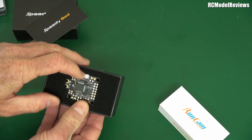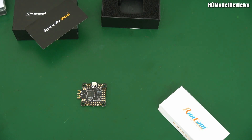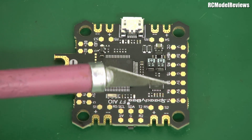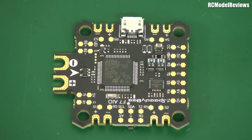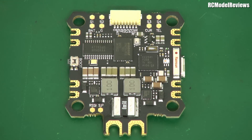Instructions — follow the QR code. It's not conformal coated, and I actually like conformal coated stuff, but this one you wouldn't want to conformal coat for obvious reasons. There are lots of little pads around the edges where you can solder wires to — they're not holes through the board. If you're going to solder to it, conformal coating is a pain because you can't solder through it — you'd have to scratch it away with a knife. Given there are so many pads for all the different options, you'd need a masking template. Build it, then conformal coat it yourself if you want. I might do a video on conformal coating — I've found one product over many years in electronics that does a really good job, is super cheap and easy, and the big bonus is you can actually solder through it.